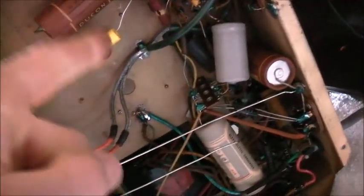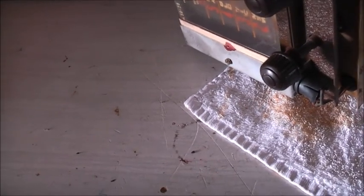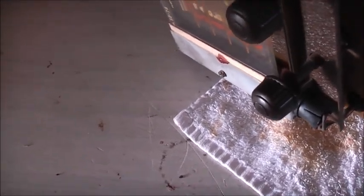I don't have any 0.4s though, so I might have to do my trick where I parallel a bunch of these together to get the value I want. Doesn't look real pretty, but it will perform good. I'll place a couple more 0.1s in here, in there. Alright, let's give it another test. It's on 0. Turn the voltage up. Here things start to get warm.